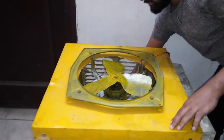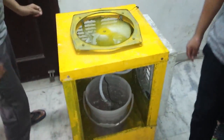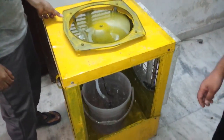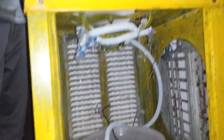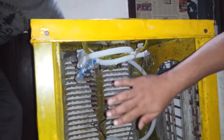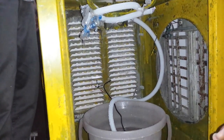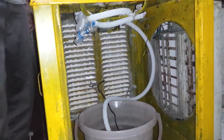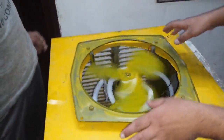Let me just start the cooling tower. This is the working principle: here we can see the hot water is coming out of these nozzles. Water is circulated over this induced fan, and water is going through the pipe. Through this fill media, there is a sort of film which splits the water into small droplets. The water is collected inside this pool, and this is the induced fan.